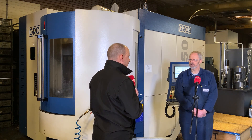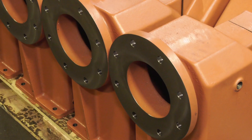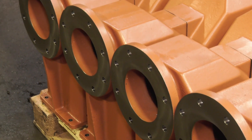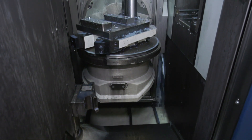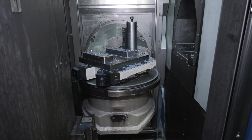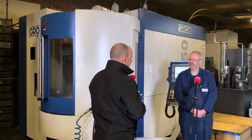The machine is quite highly specced as well — you've got a high-powered spindle and 80-bar through-spindle coolant. All of these things certainly help with the materials you're machining, because they're not easy. It came with a filtration system — a paper filtration — which helps because we machine a lot of cast iron, which makes coolant deteriorate over time. It's early days, but it's looking really promising for keeping the coolant clean, and the flush and washing area inside the machine is very effective.